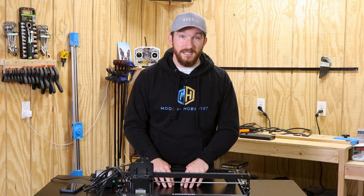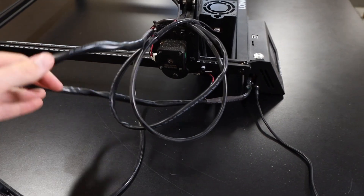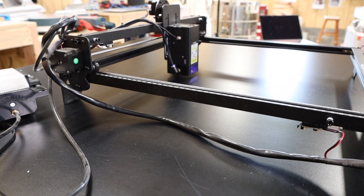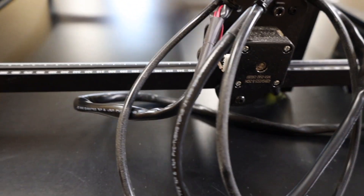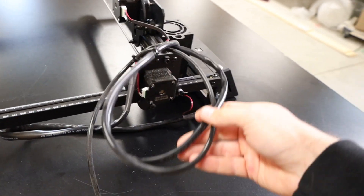The last con I want to mention is the cable management — or the lack of it. I'm assuming it was skipped to save money, but raising the price 10 bucks and adding cable chains would make a huge difference. As it is, the cables bend and twist like they have a mind of their own, and a few times they twisted onto the workpiece, which got really annoying.